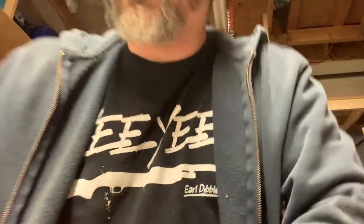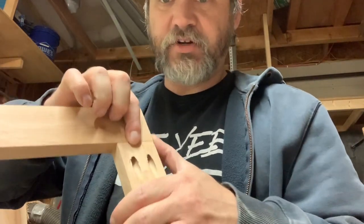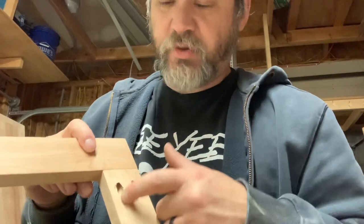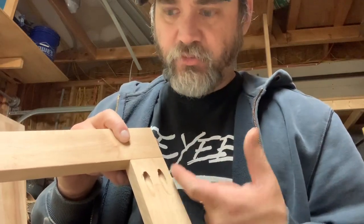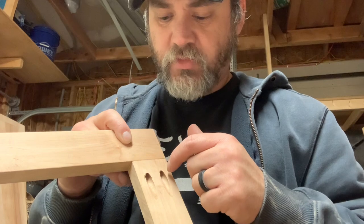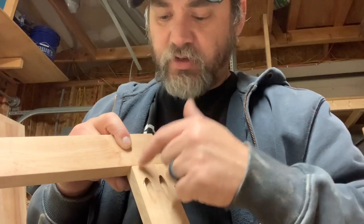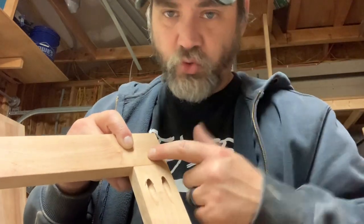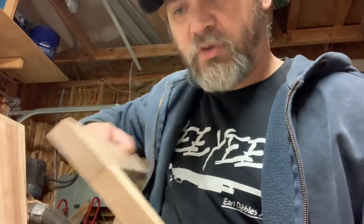I put the face clamp on right here, got this side adjusted, then got the big clamp that goes into the pocket hole in right here and started a screw. I used the reverse to drill it and get a little pilot on where it was going, then moved the clamp over to this side and did the same thing — used reverse to get where my point is for the screw. Then I took everything apart, pre-drilled both holes, put it back together with both joints, and added the glue.